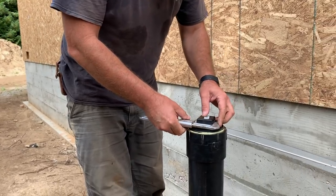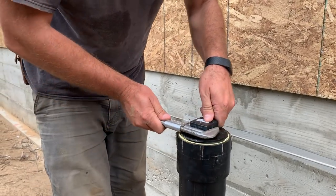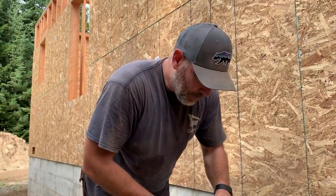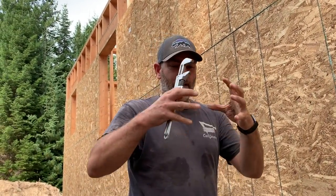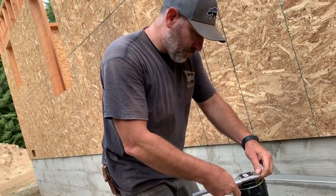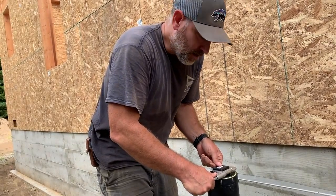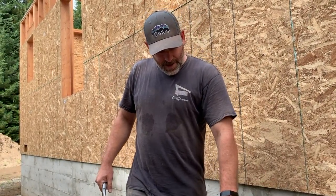It's one of my favorite wrenches. It's not super practical, but we call it a Ford wrench. I think the story is that Fords came with them when you bought a Model T Ford or something. This of course is a new one. It's made by Crescent, but we use them in industrial refrigeration for opening valves. So you have a big metal valve, you put this on that valve, and it gives you leverage to open it, like big ammonia systems for food processing plants. I worked at Golden State Foods. They made all of the hamburgers for McDonald's, different ice cream factories, bottling plants, things like that. So anyway, it's good for opening those big valves. And apparently it's good for that.